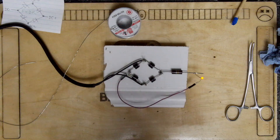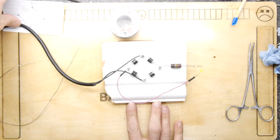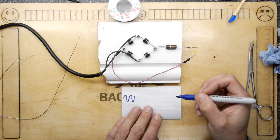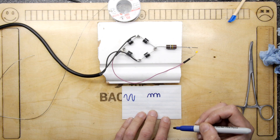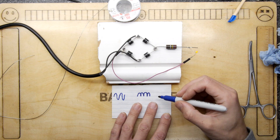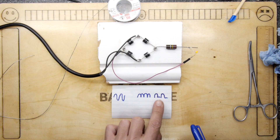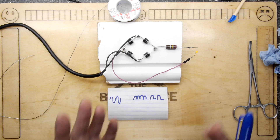You don't actually need a full wave rectifier for an LED of course. What's happening is you've got the AC wave coming in, and after full wave rectification you're basically turning it into all positive humps. If you've got just one diode in, you'll be getting one half of the wave but not the other — you won't go negative. So the LED is going to flicker, but it's flickering so fast — at 50 hertz or 25 hertz — you're not going to notice it.